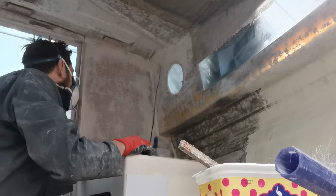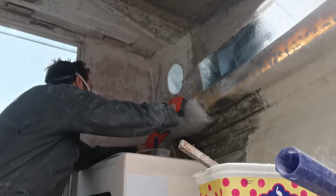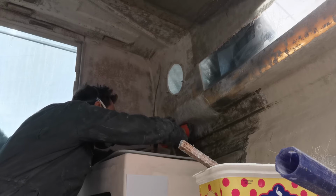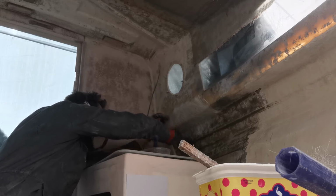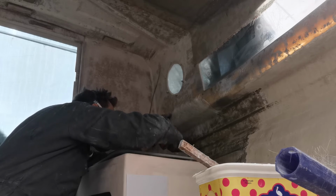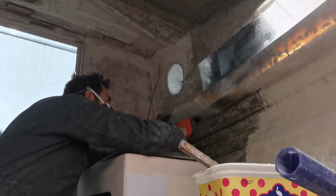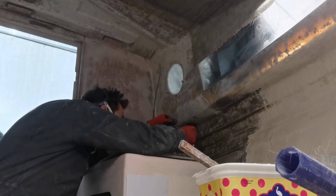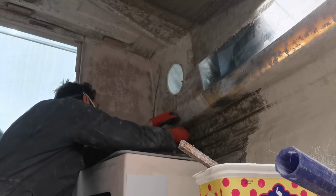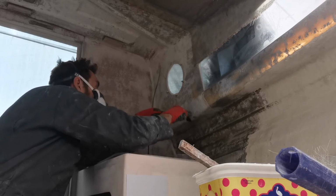Usually what I do is I put my plastic down, but it's in my way. Right, there's some fiberglass. I'm going to wrap this around here. So what I've got is nice rounded edges, so this should conform around all of that. And I broke it down into smaller chunks, like into thinner strips, to make it easier to work with rather than trying to do it all in one section. I've tried that in the past and it just ends in a mess. It makes it really hard work. So what I've got to do is just get this all wetted out.